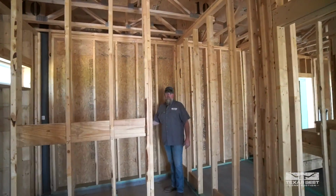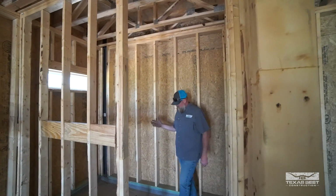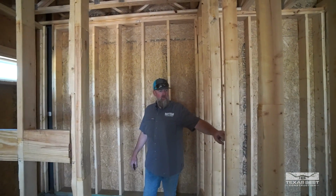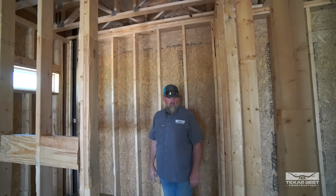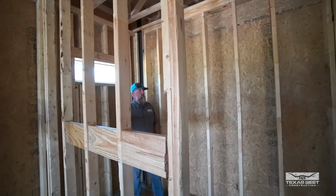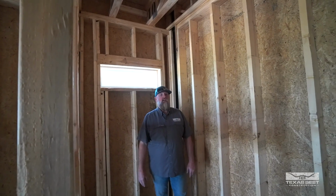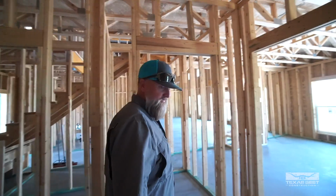But check out the shower space. Now, I have to say, this is probably one of the bigger showers. We're going to do a volume control with thermostat and diverter valve. I'm going to have 2 shower heads in this bathroom, and we'll also have a soap box going across. But huge walk-in shower. There will still be a door on here, but an enormous amount of tile probably going in this area. So let's go upstairs. I'll show you guys what we got going on up there.